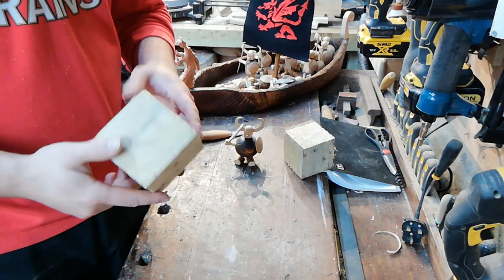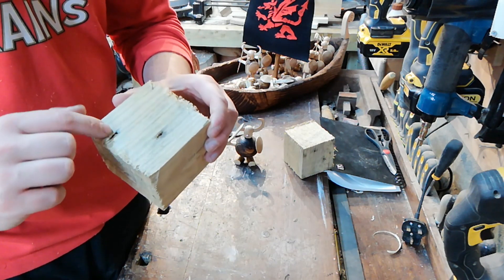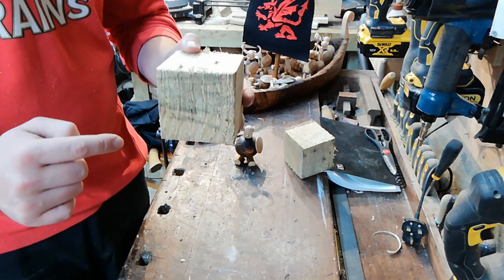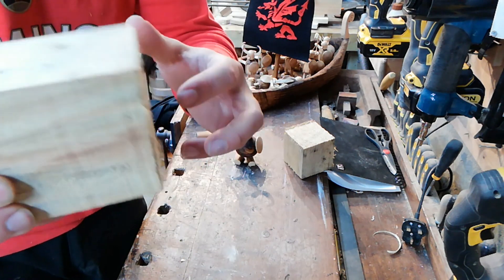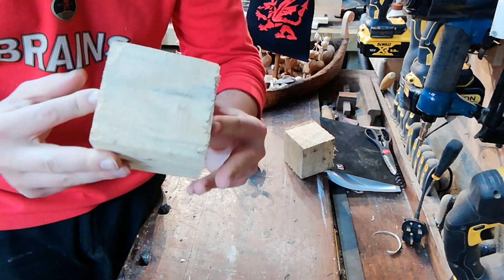In the next step we're going to prepare our materials. We're going to need to make sure that we've got no nails left in there or any bits of metal, because as it's spinning, if your tools touch that it's not going to be good for your tools or yourself. We're going to be turning in the direction of the grain, so we need to make sure the grain is on the side — end grain goes into the tailstock and headstock as it's spinning.